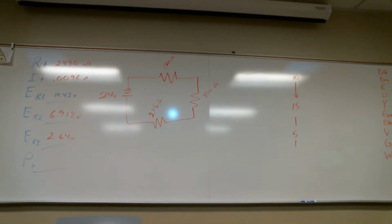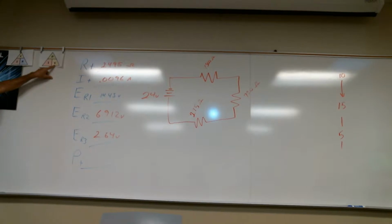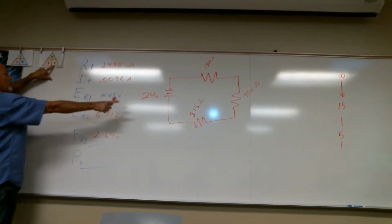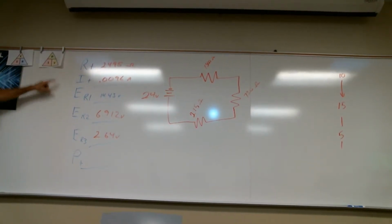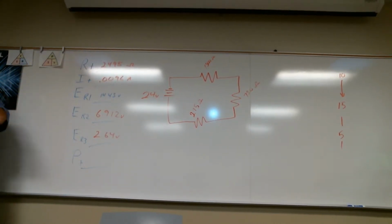So you're saying the total power would be the current times the total volts. Okay, total power is watts. To get power, it would be total current times total volts. So when I use current, I'll use the one current they all see, and I'll use the 24 volts. For testing purposes, will you take the 23.982? For me, since I gave you the 24 volts, I would use 24 volts. Oh, yeah.